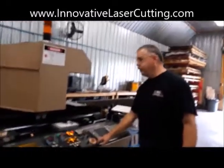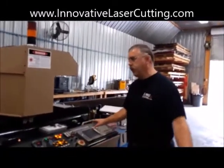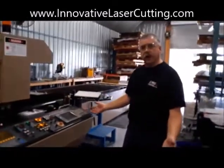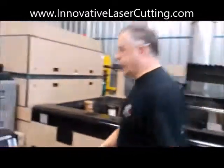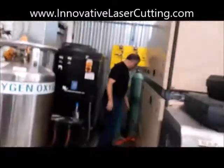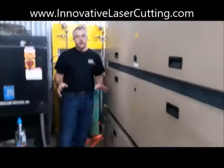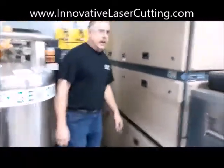Emergency stop is different — this will stop everything: drives, high voltage, everything will trip off. If there's some sort of accident and you don't know what's going on, just throw the disconnect. The disconnect right here — if I throw this knife switch, the laser, the chiller, and all its support equipment are gone. If you've got to spend time thinking about it, throw the disconnect.